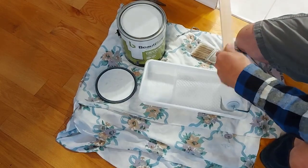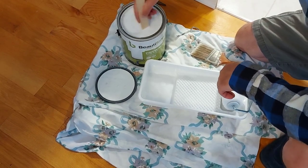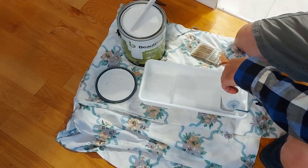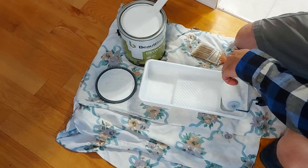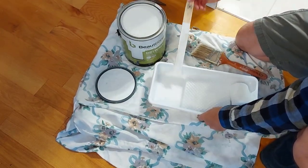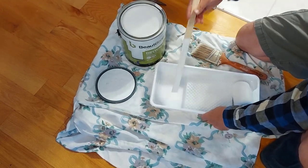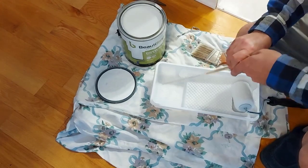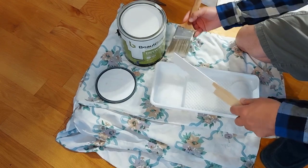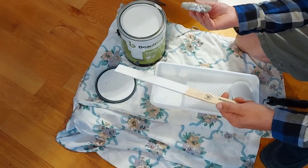What I have here is a brand new can of primer — basically it was shaken two days ago, but I'll give it a quick stir just the same, and wipe off the stir stick. Primer is fine. You can use your tray here, and I put an old bed sheet — I save them sometimes for painting — as a drop cloth. I'm going to use a brush not for painting but just to make it easier to clean your can and tools, and we'll wash it quickly after.